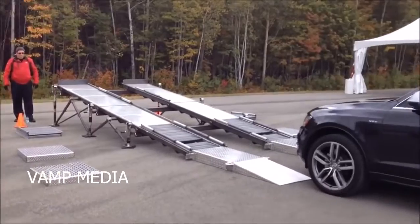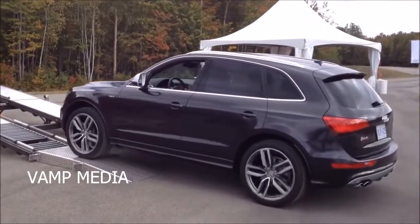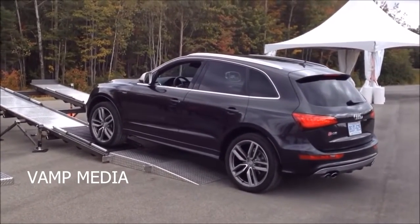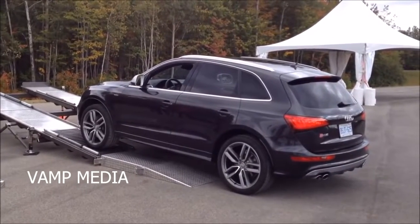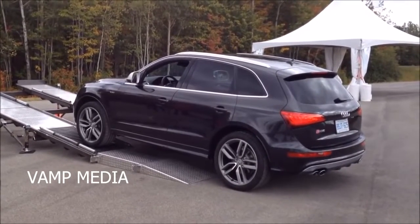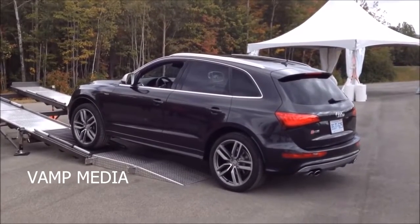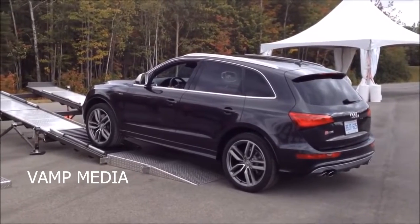Okay, Chris, go ahead. So we're going to cradle the front wheels. Okay, back off the brakes just a tad. Okay, so now we've created a little bit more resistance. We're sitting in the divot. Chris is going to give throttle, but unlike the lady who drove in the video, Chris is going to sustain the throttle, create momentum, get the clutch pack to bind. Go ahead.